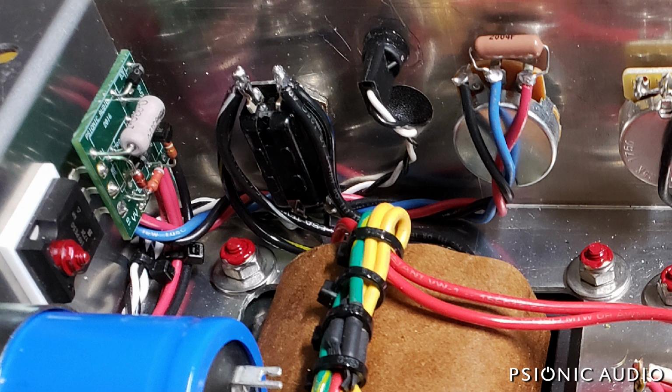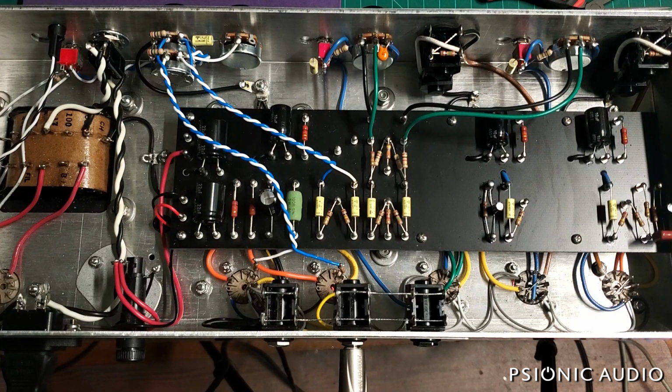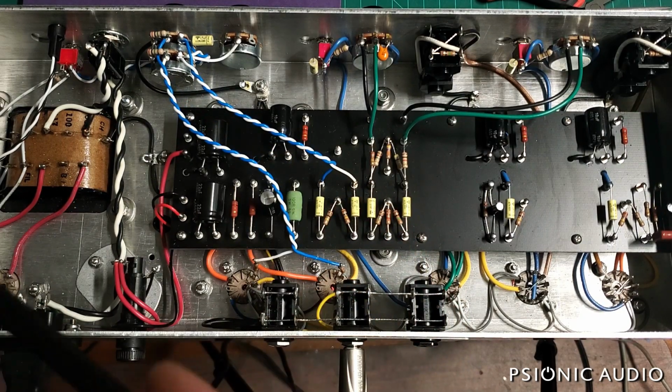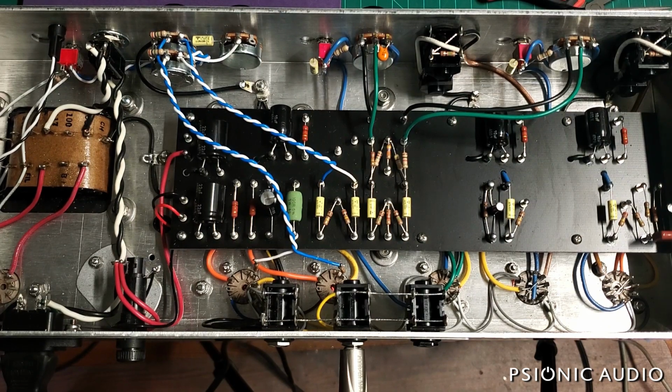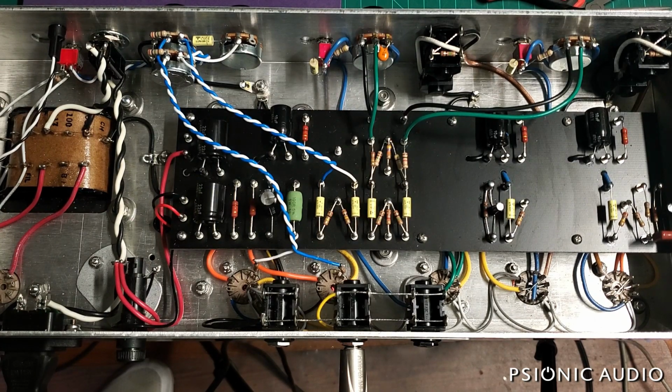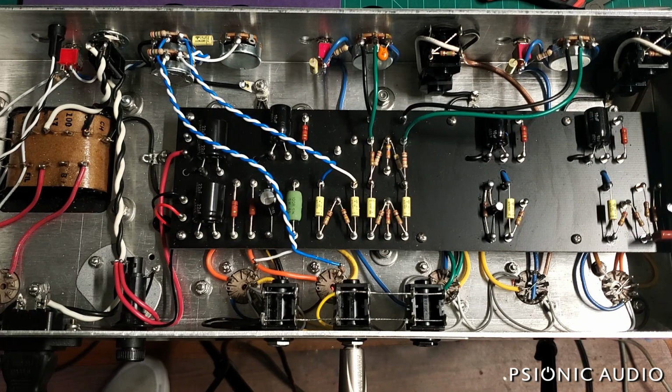The reason I initially was not going to was because I don't know where the amps are going. I don't have a system of authorized repair centers, et cetera, et cetera. And anytime you introduce heat, which is what any variable voltage or power scaling introduces into the mix, you have the potential for failure. Even if I design everything perfectly, which I try to do, 1 out of 100 MOSFETs might just decide to die, even though the operating conditions are well within the spec that they're designed to operate at.